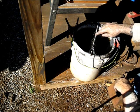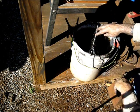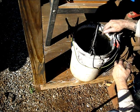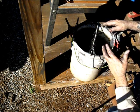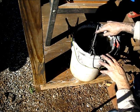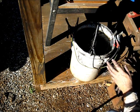It only removes iron oxide - it only removes rust. You could leave these parts in this tank out here for a month and it would not remove metal. It will come to a point where it doesn't do anything else, but it's still energizing so it will keep eroding this plate as long as it's on. It does keep eroding, but it doesn't eat the metal away. Some extra education will teach you why.